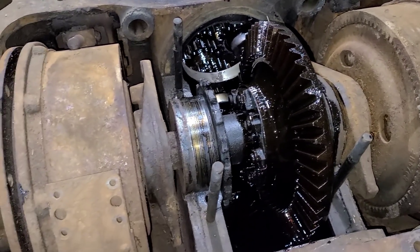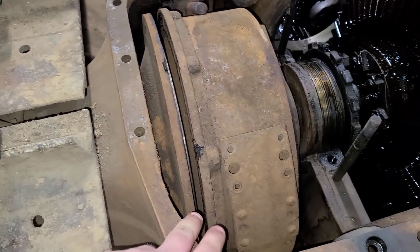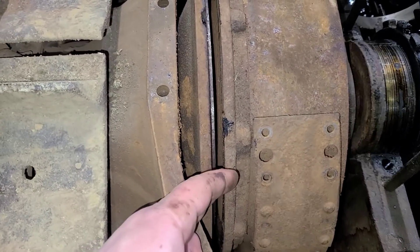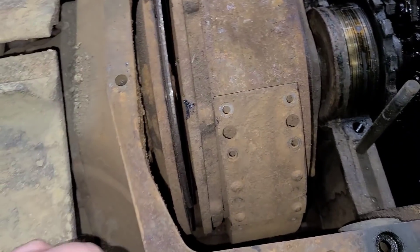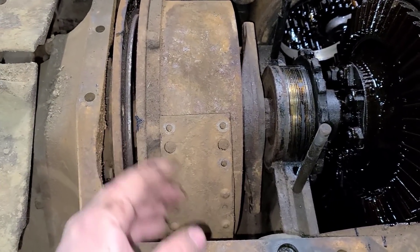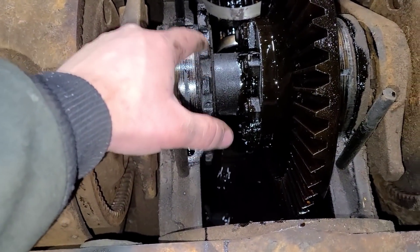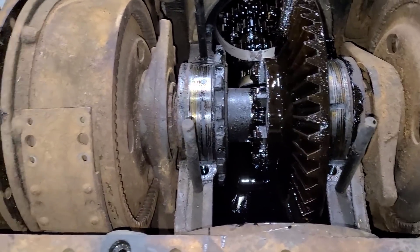With both bearing caps removed on both sides, I wanted to see if we were going to have enough room with this steering clutch here, because there is a stepped lip in there. On this side, that one does not move at all. But fortunately, this one moves quite a ways and rather easily. So I'm hoping that's enough space that once we kind of pick this up, we'll be able to move over and get that step out of that side. I think we can do that — it doesn't look like there are any obstructions. I may have to possibly back that off, and if I do, I'll mark it as a reference for when we go back together.